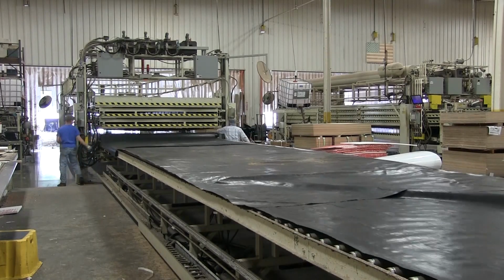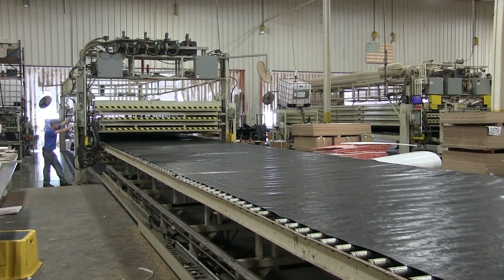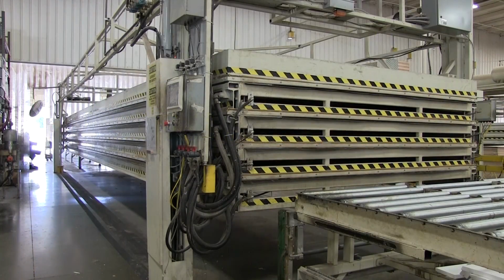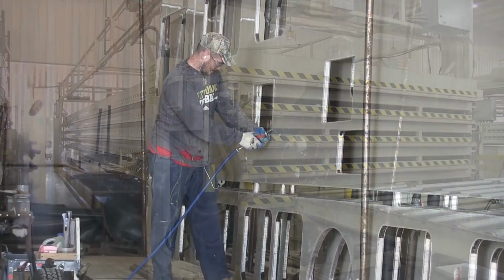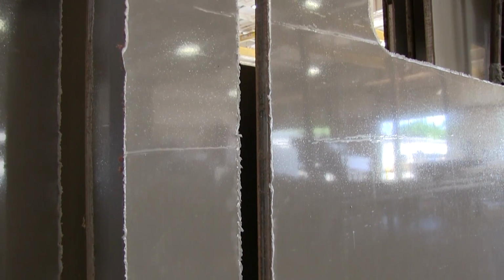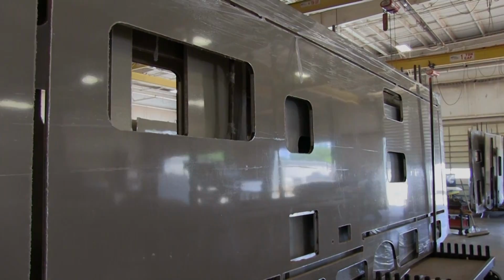The entire walls, roof, and floor are inserted into an individual lamination bed where air is removed and pressure is applied, causing the adhesive in the walls to flash, also known as vacuum bonding. This flashing permanently bonds all the layers together, providing an optimal structure to build a motorhome. With the lamination process complete, a final routing of all cutouts in the structure is performed. All openings in the walls and roof are framed in aluminum, while the floor is all framed in steel. This extra step ensures the openings are always sized correctly, so items like windows, vents, and entry doors will fit each and every time.